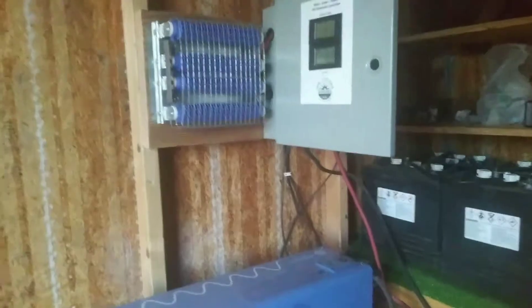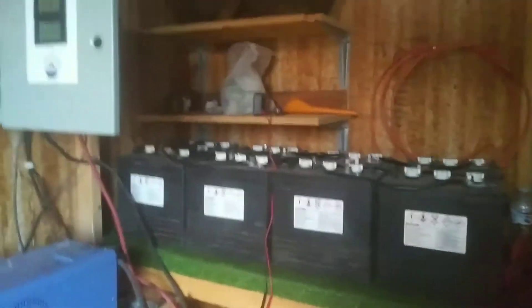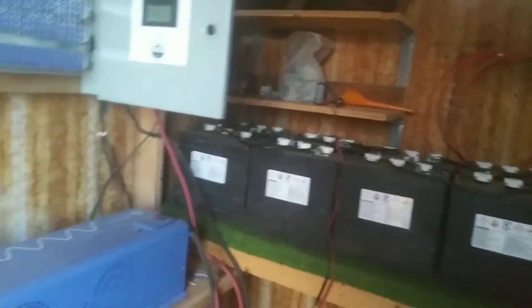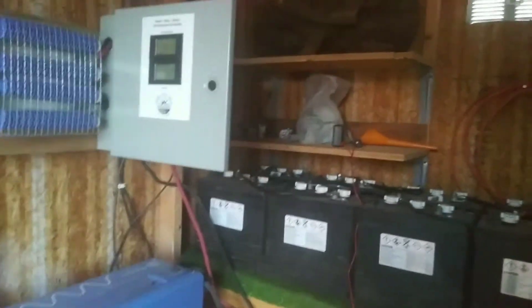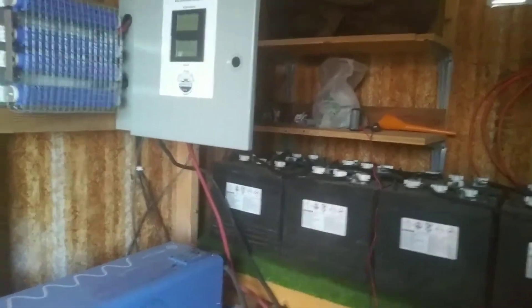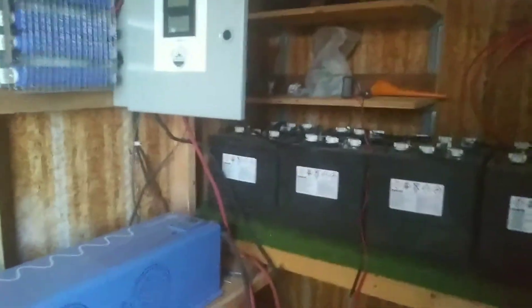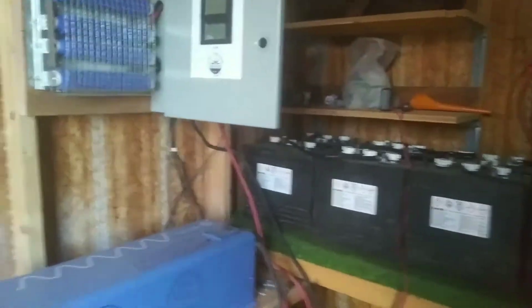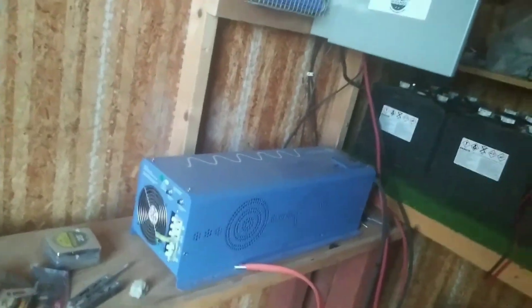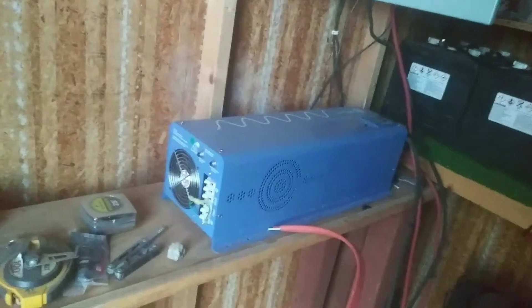So that's really it. If you're running at 12 volts — I used to run this system at 12 volts — I was getting 150 amps of charge, and the bank was rated for 900 amp hours. The equation goes up, but it's a lot more efficient converting less. If you're charging at 150 amps, you need much heavier duty equipment. Whereas charging at 75 amps is a big difference. Just like when you buy your inverter and go from 3000 watts to 4000 watts — that's your true running wattage. Your air conditioner is going to cost 1500 watts, but the inverter will power it.